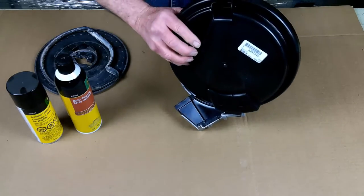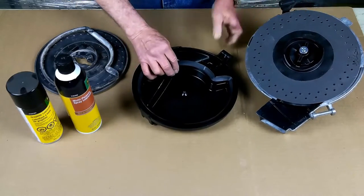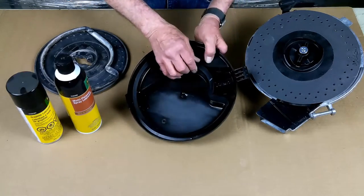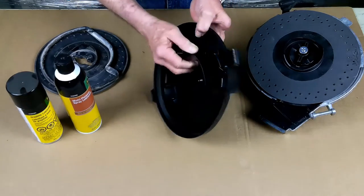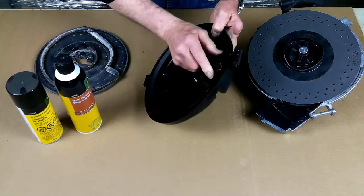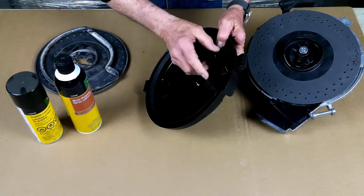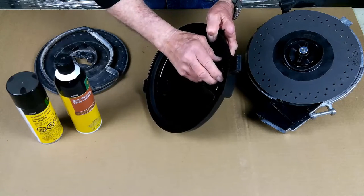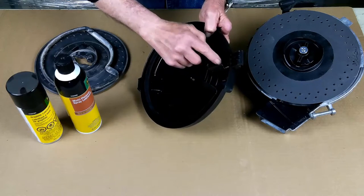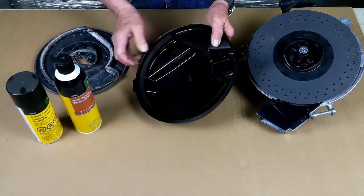Let's get started — we're going to disassemble the seed meter. We'll take off the vacuum cover. This cover actually has two of the most common wear items: one is this seal, which is basically just pushed into the housing, and the other is the scraper or kicker. On certain Milo plates these are easily replaceable — you just undo the clip and it'll pull out. On the older ones there are a couple of screws you have to loosen to get it out and replace it. Those are the two areas in the cover.